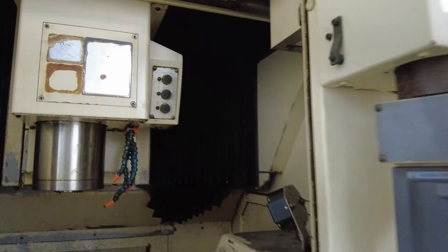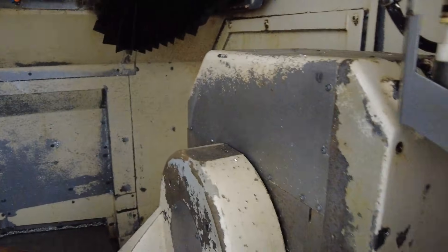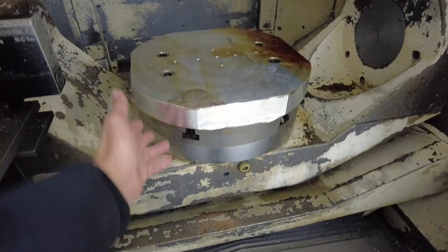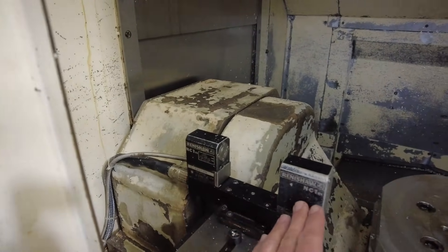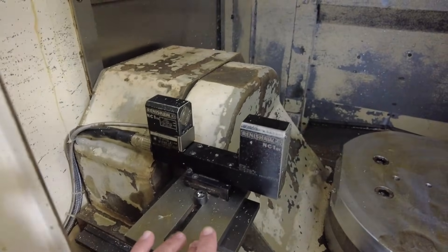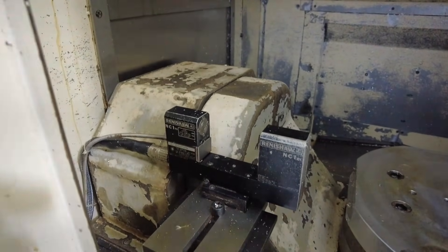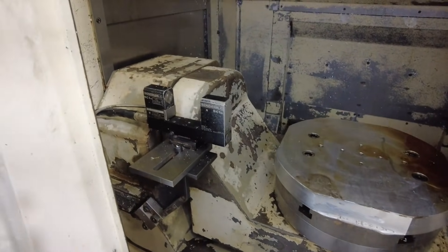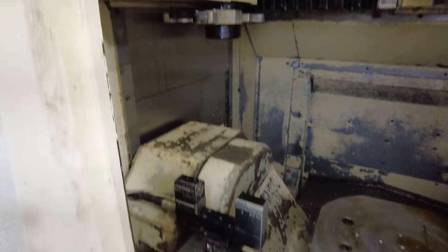I'll show you what the shop looks like right now and what's going on with the machine. Last video it was kind of noisy and I had a light flicker, so I just wanted to show the machine really quick. It's a lot of iron — definitely more iron than I'm used to. What I believe is a 400 millimeter trunnion here, and we have the laser tool setter. If anybody is familiar with these Renishaw tool setters, comment below. One thing I dislike about this Renishaw laser setter is that it's constantly blowing an airstream — it's like a small air gun spraying all the time, kind of a heavy lift on the air.